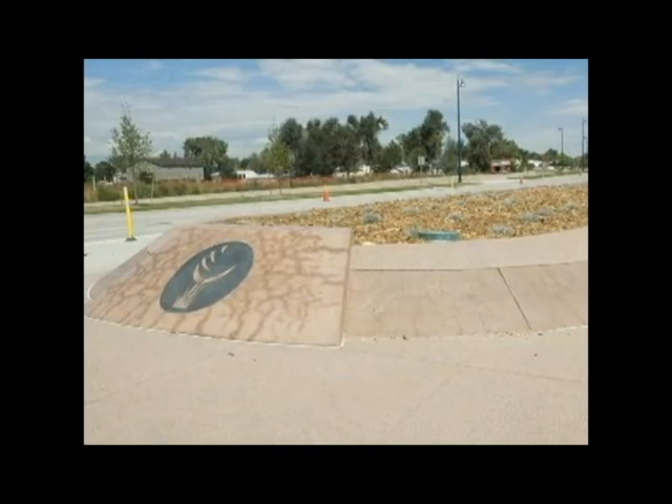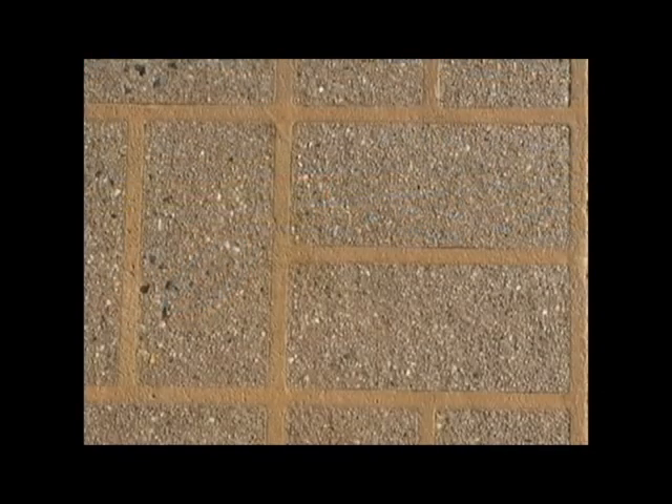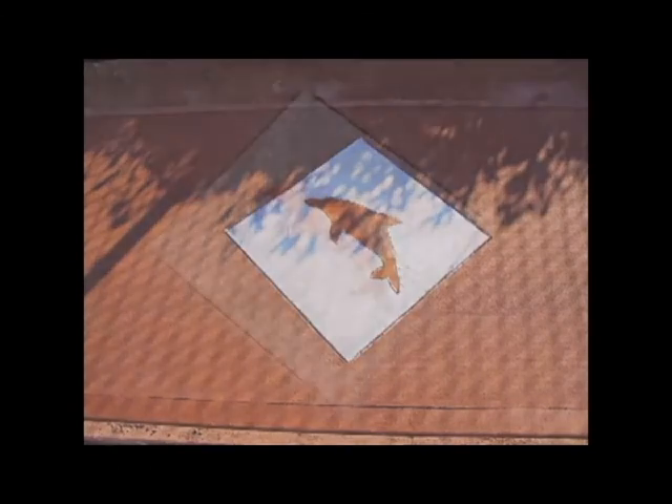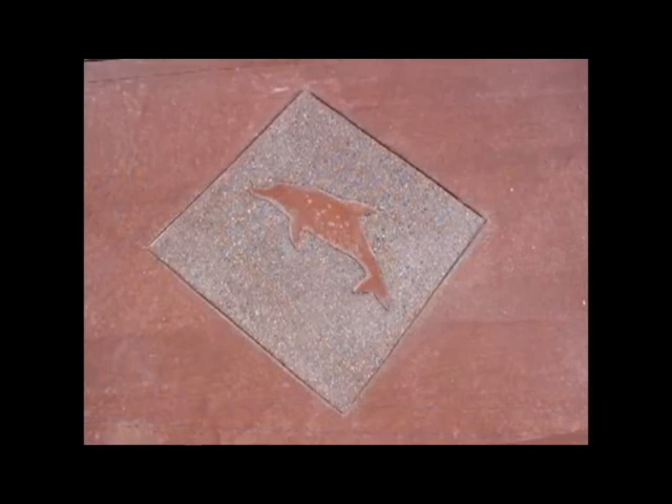TopCast is excellent to use in decorative stencil applications. Stencil materials used should be non-absorbent and flexible. Apply the stencil material to the surface just before spraying with TopCast. Roll down with a dry, short nap paint roller, and then use a steel trowel to trowel over. Pull the stencil up about one hour after it's been covered with TopCast, then wash as needed.